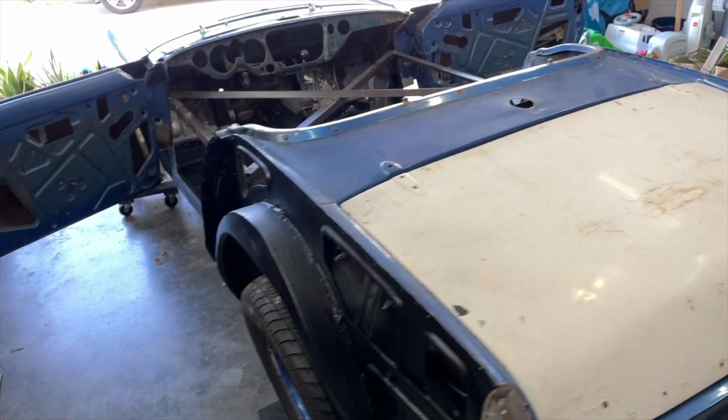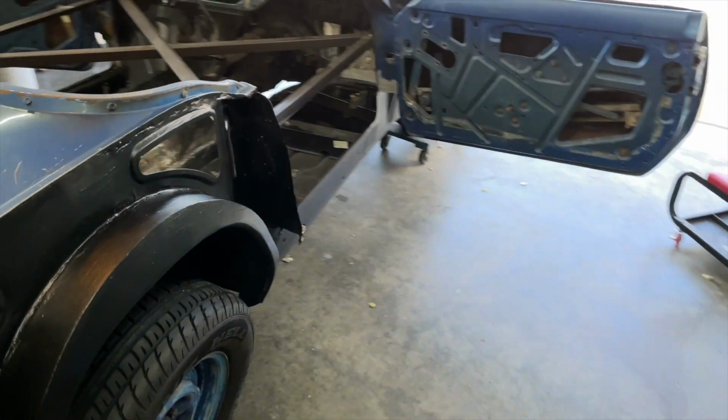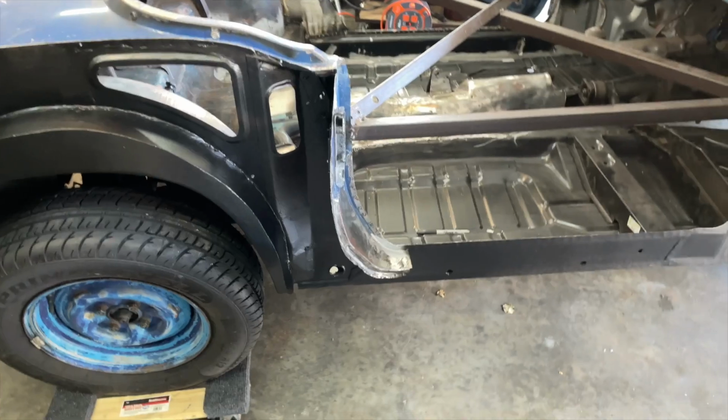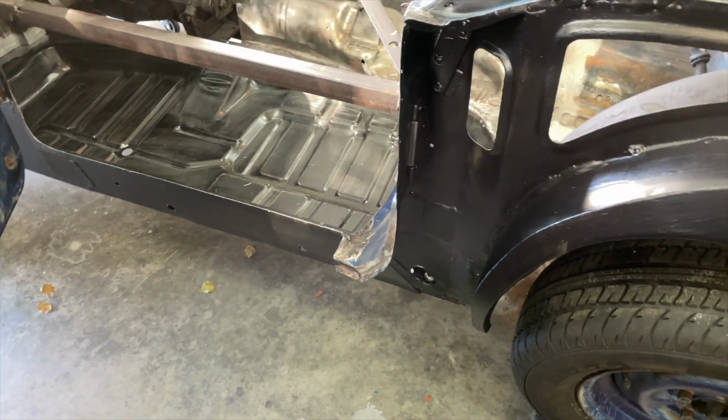All right, so the last time that we all hung out, I was working on the passenger side. I was working on getting this section here of the floors and the inner sill and the strengtheners welded in. As you can see, I've gone ahead and painted it all. So I went ahead and actually did the driver's side as well. So now we're fully secure there. If you follow me on Instagram, you saw those pictures earlier.